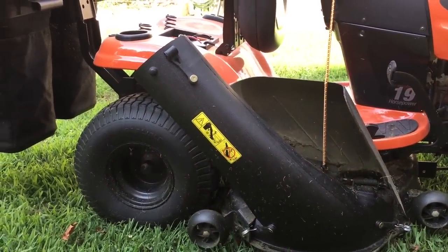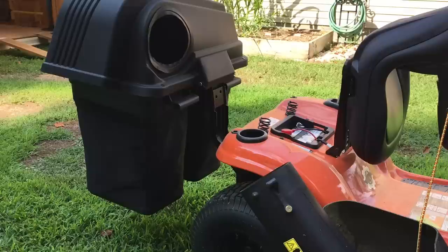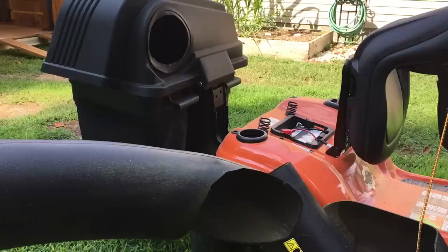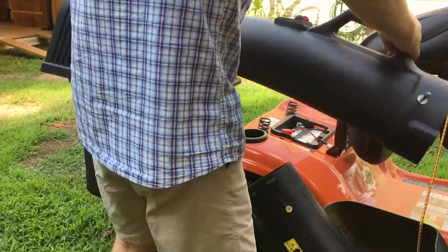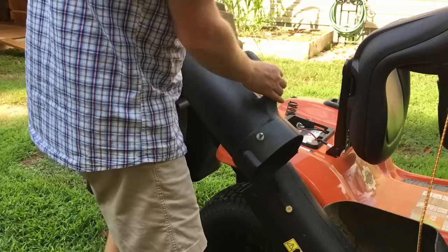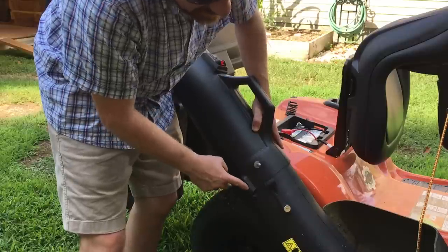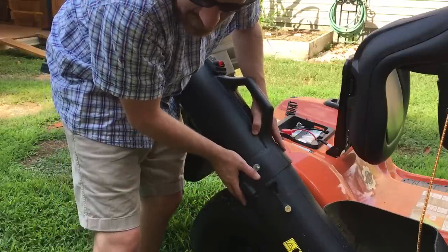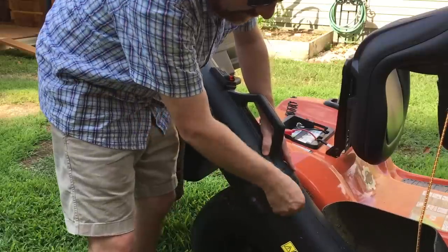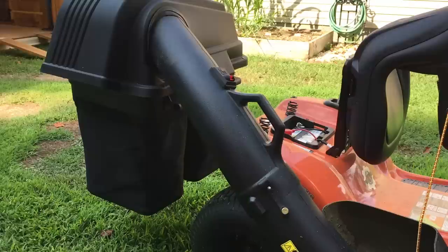Now I'll show you how to install the upper part of the chute that goes into the grass catcher body. We'll take the cutaway open end at the top and install that into the grass catcher. Then we're going to take the upper chute and slide it down over the top of the lower chute. You'll notice there's a bulge here that fits over a little knob on the lower chute, so we'll slide that over. Then we take this bungee cord and attach the upper chute to the lower chute. And that's it.